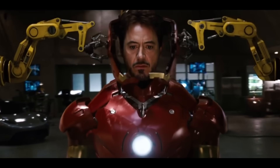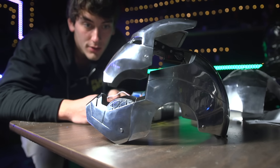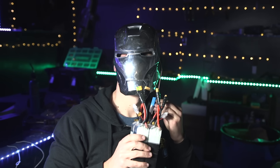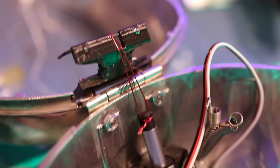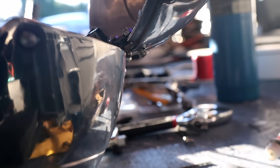I first started with the mask section — this is a classic feature in any Iron Man helmet, and it's actually pretty easy to do. All you need is one servo in the helmet and some lever arms to connect the mask right above the eyes. Just JB weld everything in place and boom, your mask moves just like the movies. Next step — much harder. We need the helmet to fold a complete 180 degrees all the way up and land on the user's head. For this I got some linear actuators and a hinge to bolt the two helmet parts together. These linear actuators use a little DC motor to convert rotational motion into linear motion. But as soon as I tried the full weight of the helmet, there was absolutely no shot it was gonna lift that.